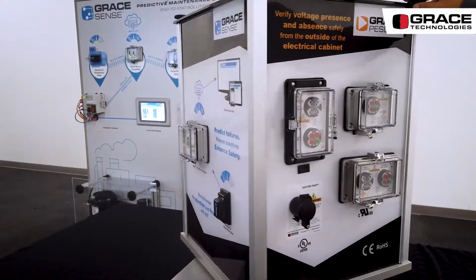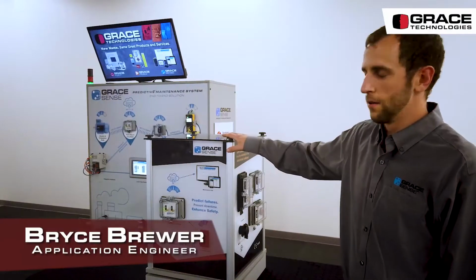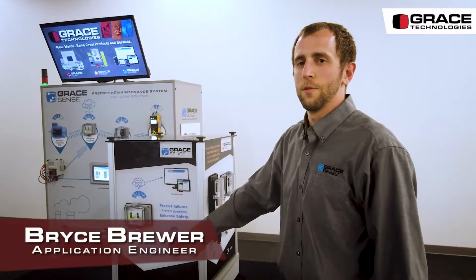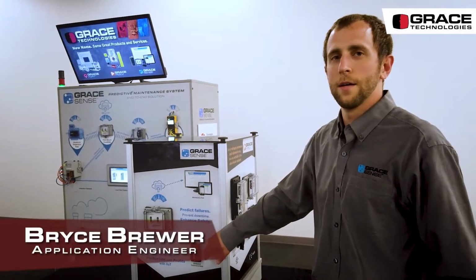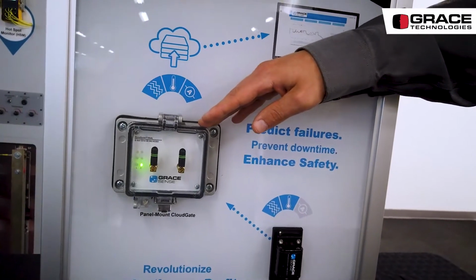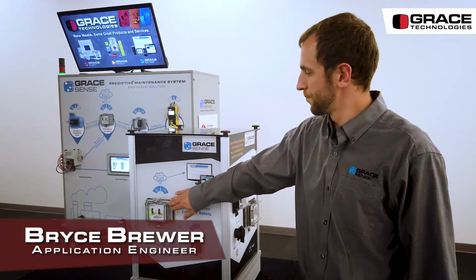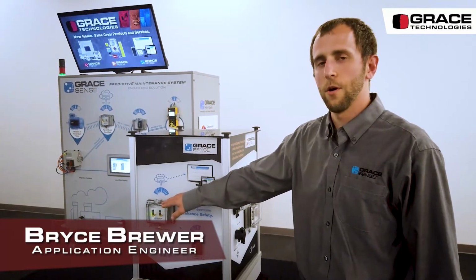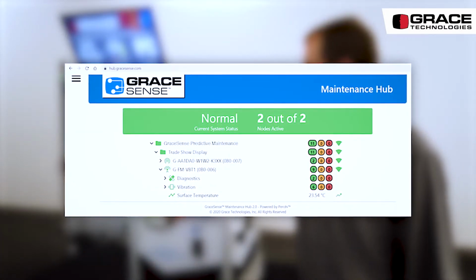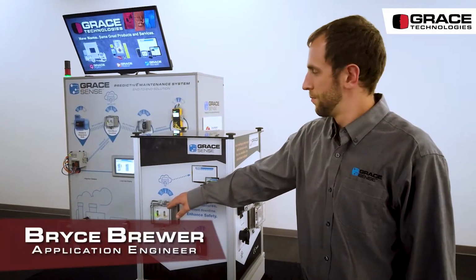The past 2 years, we've been working on our GraceSense Predictive Maintenance System, which is what we're here to talk about today. So this device is our vibration and temperature node. It would sit out on your motor, gather data from that, and send it wirelessly up to 30 meters to our CloudGate using 802.15.4 Zigbee compatible communication. This CloudGate collects data from all its children, and then it can send it up to the cloud using Wi-Fi or LTE, depending on the option you select.